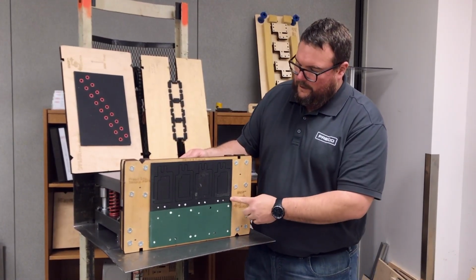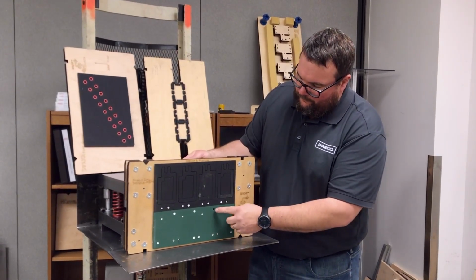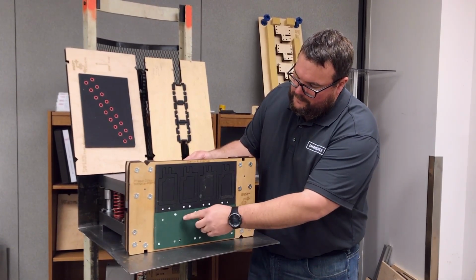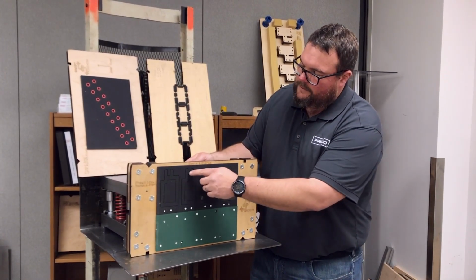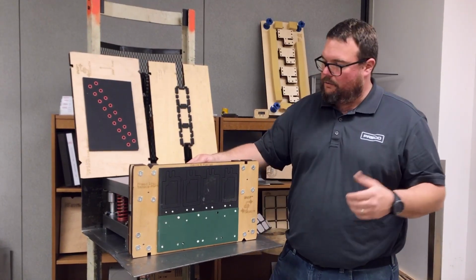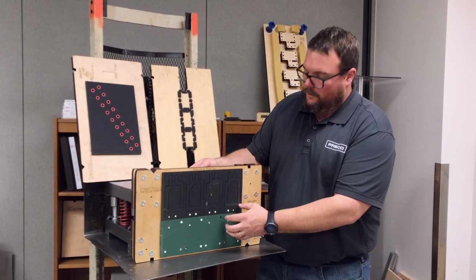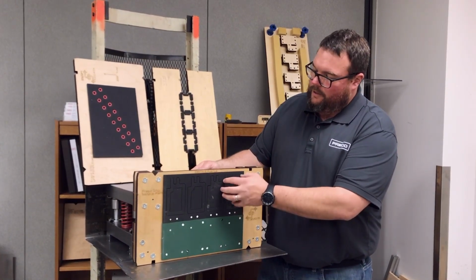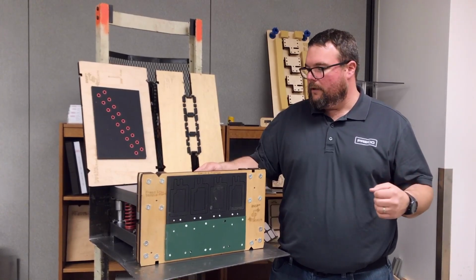This one is actually a progressive feed-through punch. So you see here we've got the feed-through punches cutting these little round slugs here, and then when the material indexes forward, they align with the steel rule cut here, which is a through cut. So in essence, we're removing waste parts, and then we're coming up and we're creating a finished part with ID features that have been removed.